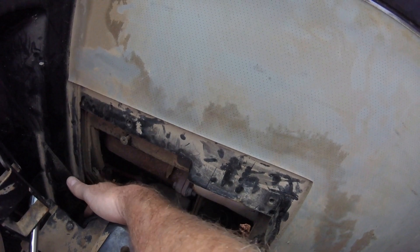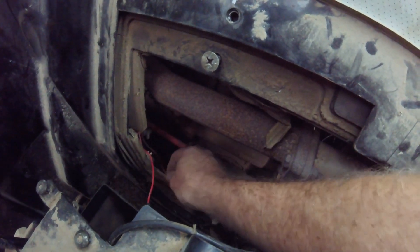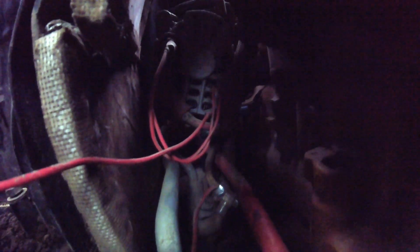There's metal protruding there, so I'm guessing this is part of the issue — maybe a bit of earthing on this. I've brought some things to fix that; I'm going to cut it off, wrap it up properly, and terminate it properly. There's also a whole suite of previous terminations in there done in the past for a similar issue. I'm guessing the wire was touching somewhere, earthing as it swung around. The starter motor fuse was blowing and I've seen some wiring that's not the best, so that leads me to conclude that's where the issue is.